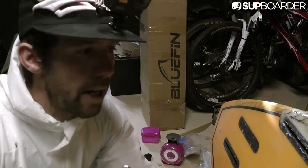Next step is I'm going to get a block, just to try and rebuild that nice rail profile, just get it nice and flat so it's as close to what it was before. See what happens. I'm moving on to the wet and dry sandpaper. I'm going to use this to really start to smooth it off and get it good. Less important to use my mask now when I'm on the wet and dry because the water takes up the dust, but all good.